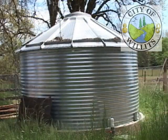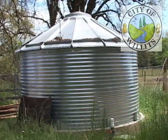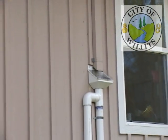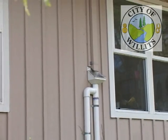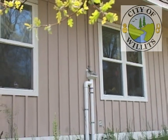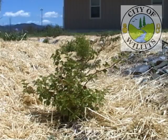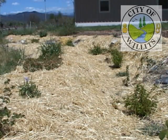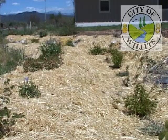Right here behind me, we have an example of a 10,000 gallon rainwater capture tank. The rainwater capture tank is filled by water coming off of the building located next to it. Water from the building drains into the tank, and when the tank is full, a float valve closes and the pipe is closed. The water that would be going into the tank then flows into the bioswales that run throughout the length of the garden and outside of the garden, redirecting the water above some fruit trees that we have planted.